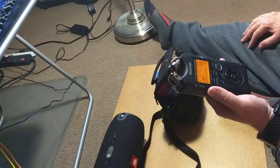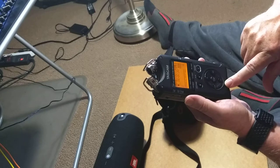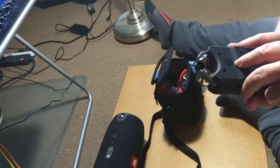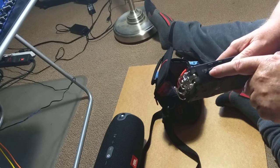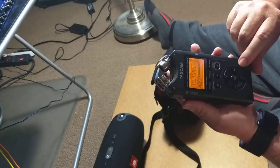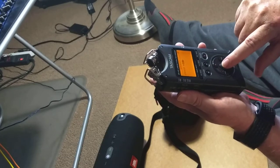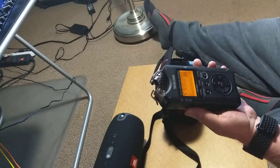So let's stop it. Go to the menu. Scroll down to the speaker. The speaker is back here — it's a crummy little speaker, just designed to hear something. When we actually use it, we're going to be using the external speaker. So this is just when you're in the field recording stuff and want to listen to it. So select speaker, hit the right arrow — speakers off — hit plus, now speakers on. Press enter, and then home. Home will get you back to the beginning. Now we're ready to play.